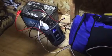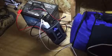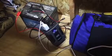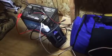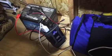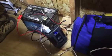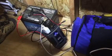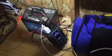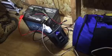You can kind of see my setup — just my little 500-watt inverter, got my cell phone charger in it, got the radio plugged into the other side. The LED camp light is hooked up to the battery as well. It's sitting right now at 12.7 volts — it was 12.9 when I started after being fully charged. We'll see what it looks like in the morning.